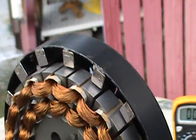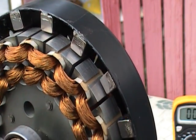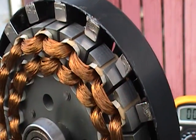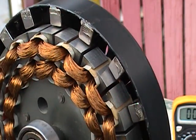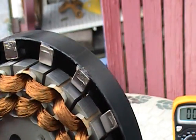In order to transform a ceiling fan into an alternator, what you really need is to start with a fan that has a flat border — a flat cover all around, no curves in this section. Then, once you remove the rotor and you're left with that gap, you measure the gap and make sure that you purchase magnets that are less than the gap between the cover and the stator.